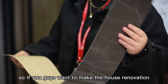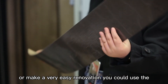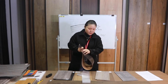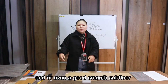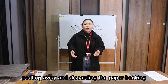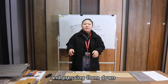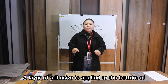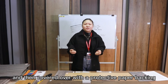If you want to do a quick and easy home renovation, you could use LVT peel and stick flooring. Most tiles can be adhered directly to the underlayment or subfloor. Installation simply involves peeling away the paper backing, positioning the tiles on the floor, and pressing them down to bond against the underlayment. A layer of adhesive is applied to the bottom of each tile during manufacturing, then covered with a protective paper backing.